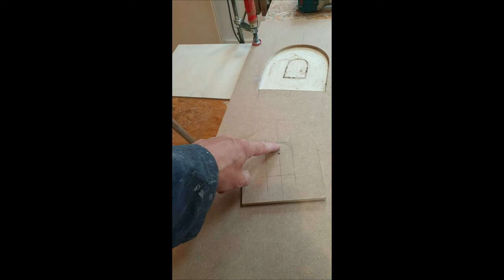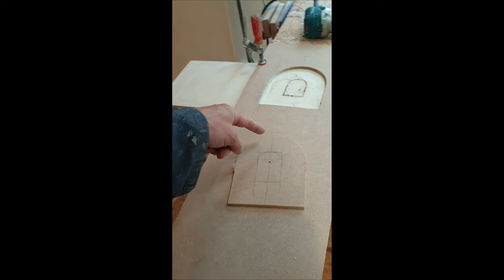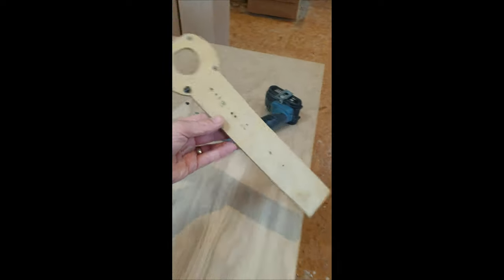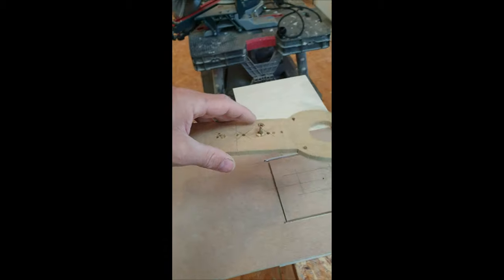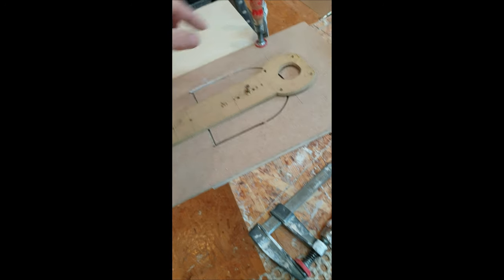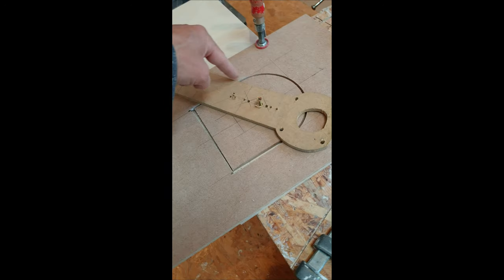That is the tip — I need to come 41 or 42mil, same as the rest. So I set my router up to that point. I made one of these jigs about five years ago — something to swing the trimmer on — so I fixed that to the trimmer. I screwed this center point on just not too tightly so it could still swing, put my router on, then just swung it and the router cutter followed that arc, stopping where it hit the straights.